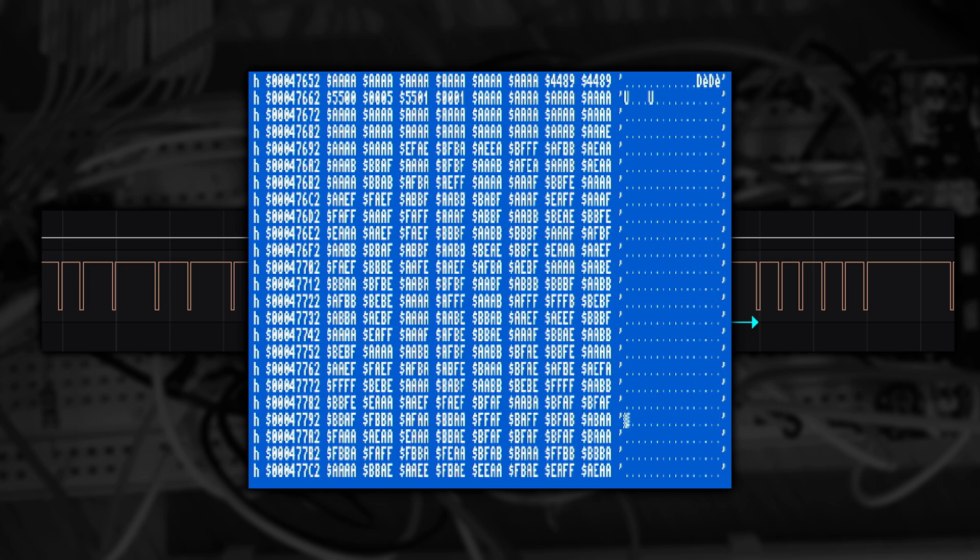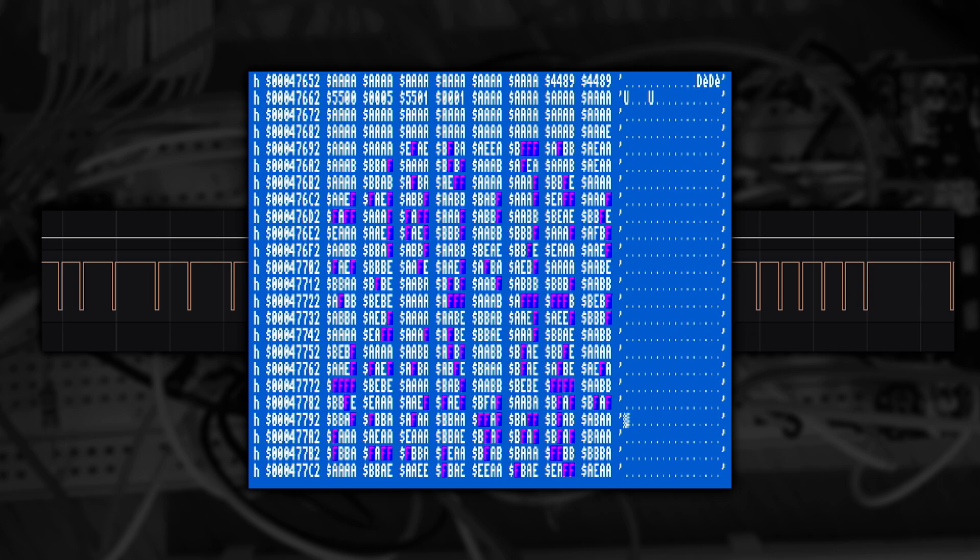I needed to find out where this was coming from, and luckily I'd been watching the Twitch streams by Hoffman. He's been showing what an Action Replay cartridge can do on the Amiga. I then remembered that the MiST core came with HRTmon, which is kind of like the Action Replay. Using it, I was able to take a look at the MFM buffer currently actively being transferred via DMA to the disk, and I instantly knew that was wrong. There really shouldn't be any Fs in that data, which accounted for those really large gaps between pulses. There were also sections of all zeros that would place MFM bits right next to each other, which isn't allowed — this would account for those two-microsecond pulses we saw.